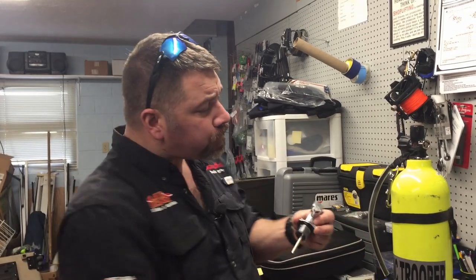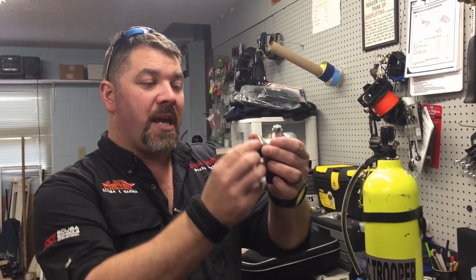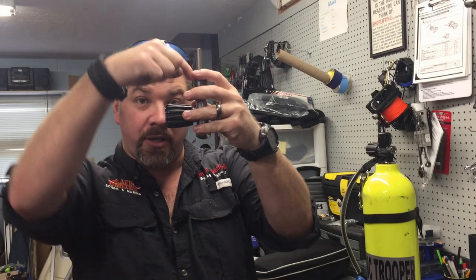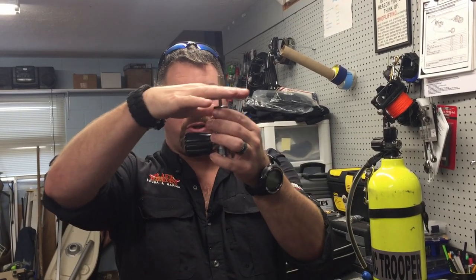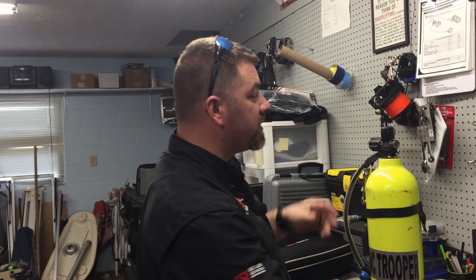So what is a dip tube for? Why do we have them? First of all, we don't want any moisture in the cylinder because it can corrode the cylinder - that's especially important on a steel cylinder, but even on an aluminum cylinder we can still get corrosion inside. Basically, what a dip tube does is: let's say there's moisture in that cylinder and you flip upside down - like in an inverted position underwater. Without a dip tube, that moisture can actually come through the valve into the first stage and into your second stage, and you'd be breathing that. The dip tube prevents that and still allows air to come through the dip tube, through the valve, through the first stage, and into the second stage.